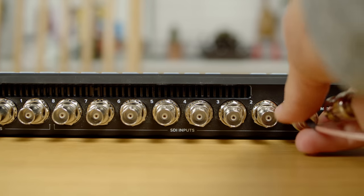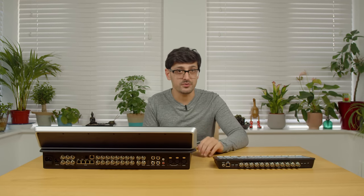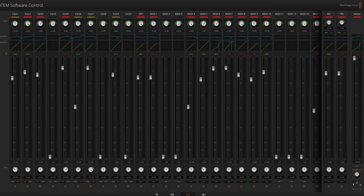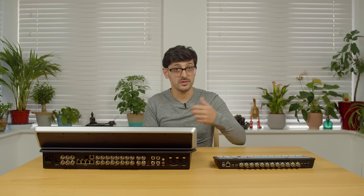Let's talk about getting audio into these devices. For the ATEM SDI, there are two main options: two stereo mini jacks on the back labeled Mic 1 and Mic 2 for analog audio, and audio passed from the camera through the SDI ports. The ATEM TVS has five ways of bringing audio in: SDI, two balanced XLR connectors for analog audio, an RCA stereo jack, MADI in for 32 channels of digital audio, and a five-pin talkback connector. You can even use that talkback microphone on air — for example, for game commentary.